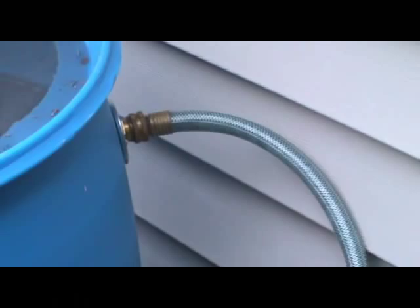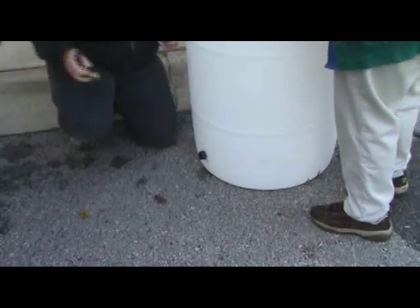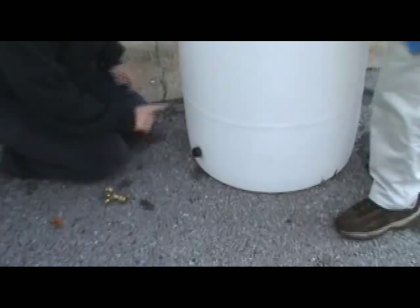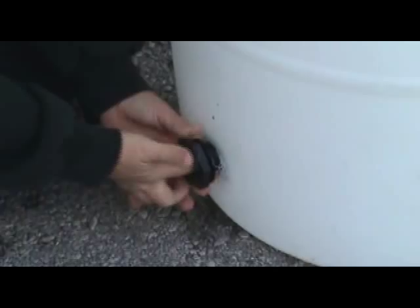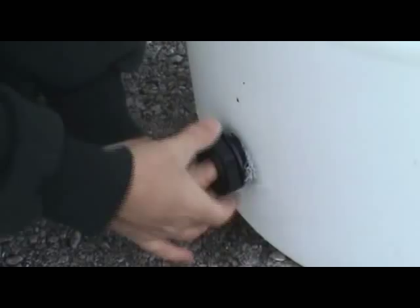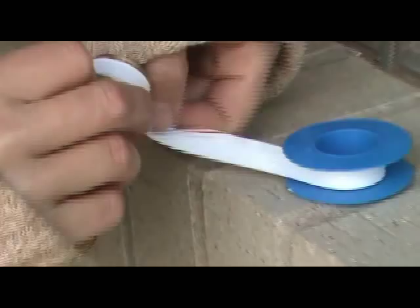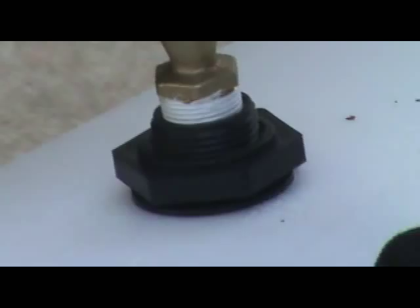To provide stability for the hose bib and prevent leakage, the 3/4 inch bulkhead tank fitting works great. Insert the male end of your bolt-shaped bulkhead fitting through the inside of the barrel, keeping the rubber gasket between the bolt head and the inside of the barrel, and screw on the nut from the outside. Be sure to do this counter clockwise as this is a counter clockwise threaded tank fitting. Wrap the threads of the hose bibb with Teflon plumber's tape and screw it into the bulkhead tank fitting, hand tightening until the spigot faces downward.